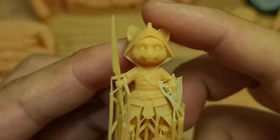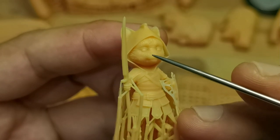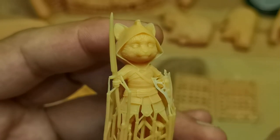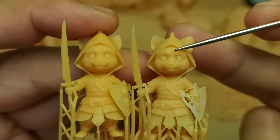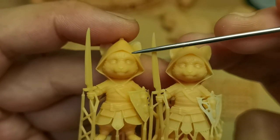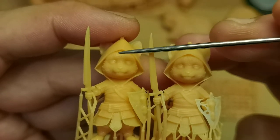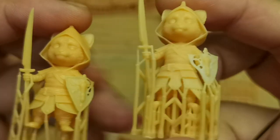I then moved on to printing the red panda at 30 micron, 1 second. The facial fur details are nice and quite sharp but the shield failed. I raised it to 1.3 seconds — the shield still had some failures and the facial fur details became softer. Raising the exposure further so the shield could print didn't seem like a good option.